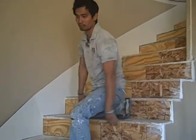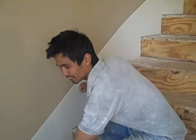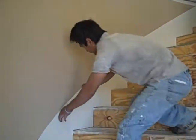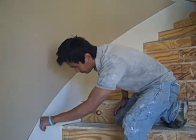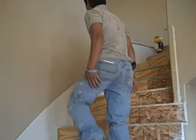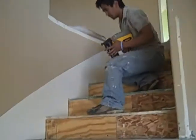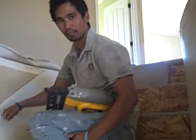Today we've got the skirt painted for the stairs and we are putting it in right now. We're going to slide it through to the back of the skirt, nail on the top, pressing them firmly against the wall. The next step is we're also going to nail them to the wall to secure them better.